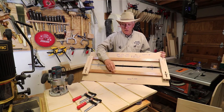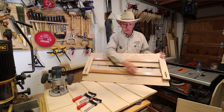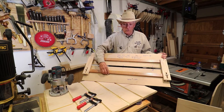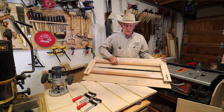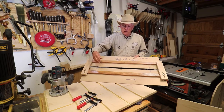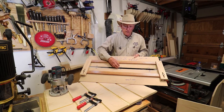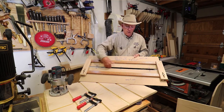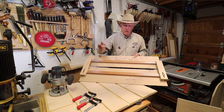The bottom side had not been polyurethaned, so I was able to glue that to these surfaces. I glued these as perpendicular as I could — that's not overly critical. I then used the handheld router to just run along these rails on each of the two separate pieces, and that would cut the perfect width for that router with that bit.